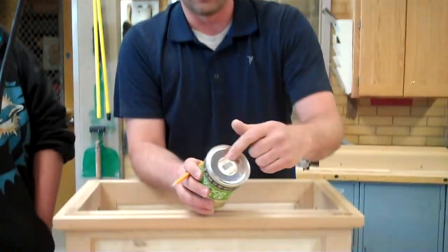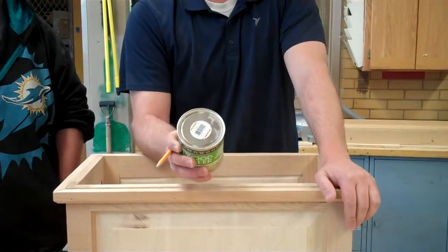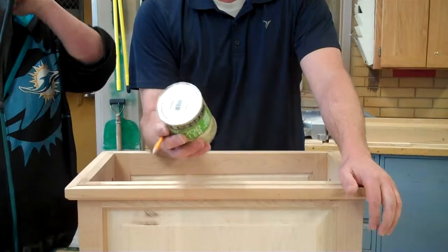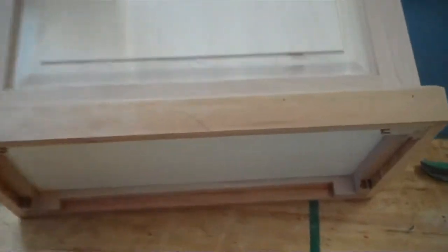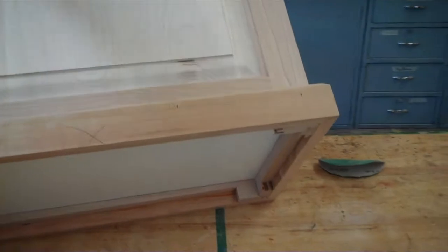On the top of it has a type of wood chosen, so don't just grab a random one. If you're doing walnut, don't grab maple. You know, get the kind of wood filler that you're using. So on mine, I've got some nail holes here where I used the pin nailer, and I want to fill those little nail holes in. And my board is cherry, so I found some cherry wood filler.